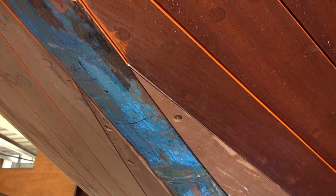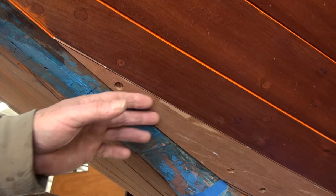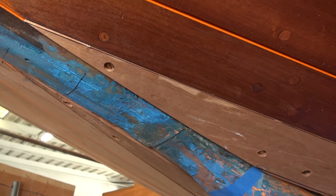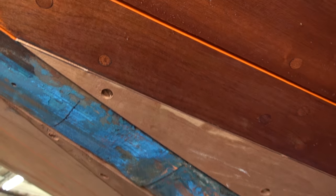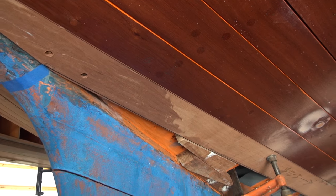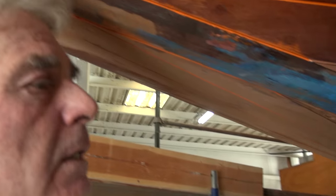We have this course up over here. So we have to finish the caulking bevel on this course, which is for the most part done except for this third plank. And then we are going to get both sides prepared all at once — drilled, battened, planed, and painted on the inside, and then we'll put them both up.